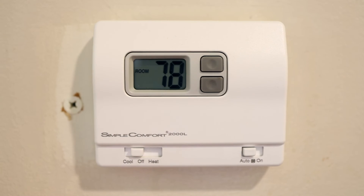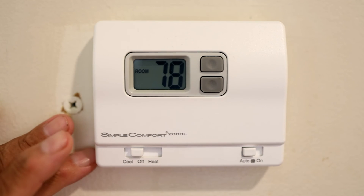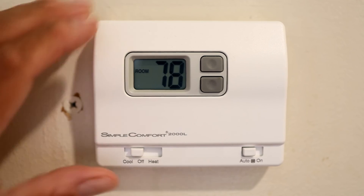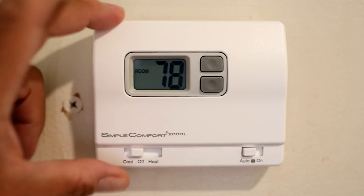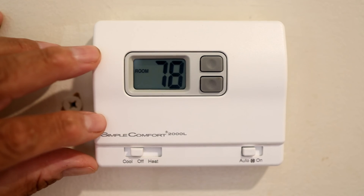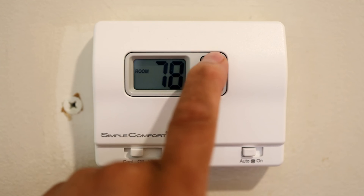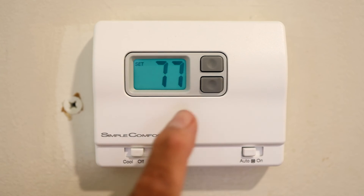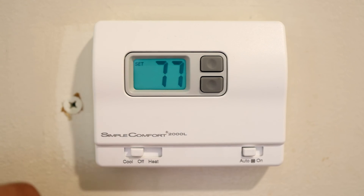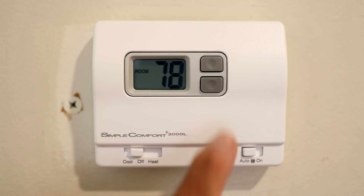Some thermostats have pins and batteries inside the cover; on this one everything is on the board itself attached to the wall, so removing the cover gives you a longer delay. Be patient — do not keep resetting the thermostat. Understanding set points and parameters is key: right now I'm in cool mode set to 77, so if I want it higher I'd set it above 78.